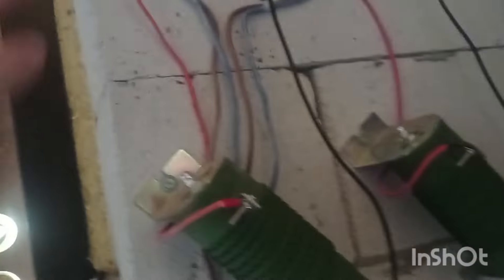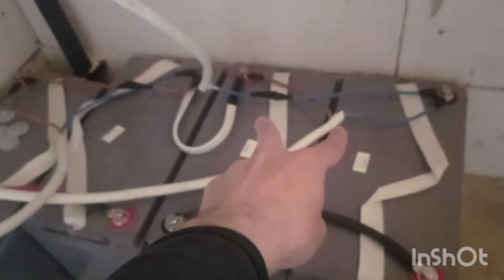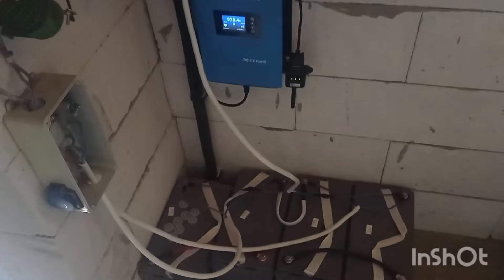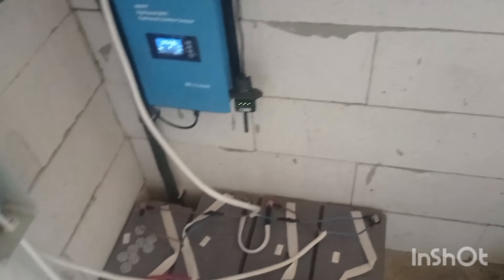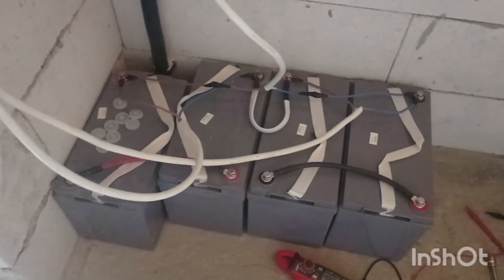The controllers are 24-volt ones. The two wires go down — the left one charges this pair only at 24 volts, and the right one charges this other pair at 24 volts. So I have no 48-volt charger, but I'm using a 48-volt system and charging a pair of 24 volts and another pair of 24 volts. I don't care much about balancing because a one-watt difference isn't a lot.